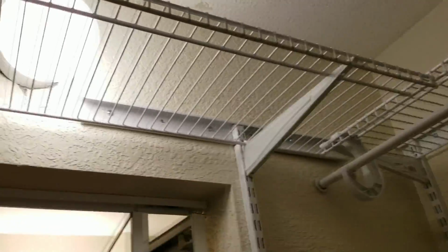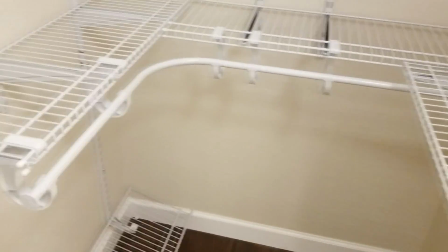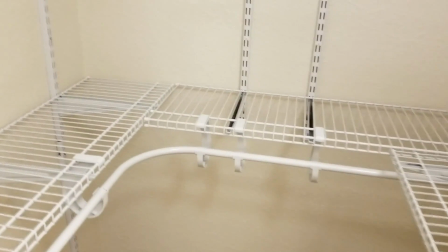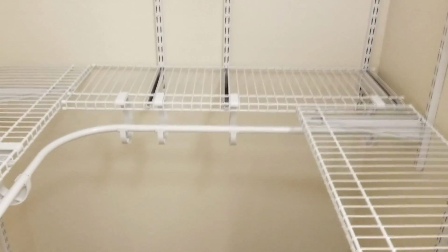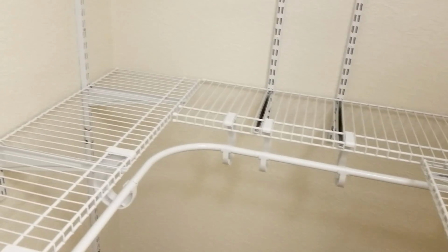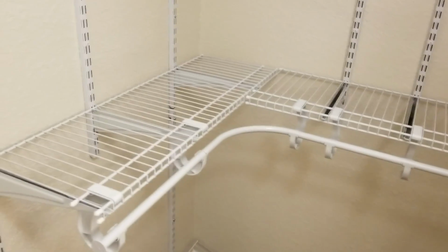And what's better about that is you don't keep dealing with this kind of nonsense and trying to rely on these little struts to support everything. We hang a bracket across the top, and it's secured in multiple places into studs. And even some of the standards that are hanging down are anchored into the studs as well. So that provides you a system that will never fall off the wall, no matter what. It will never sag. And because you have those hanging standards, your shelves are adjustable. You can move them up and down and change your configuration whenever you need to.